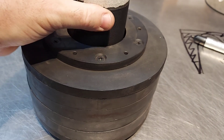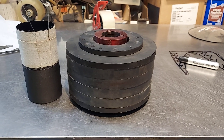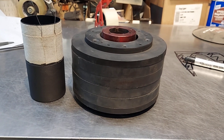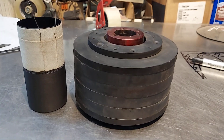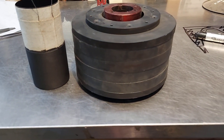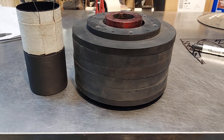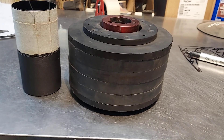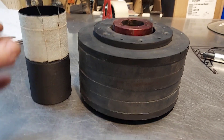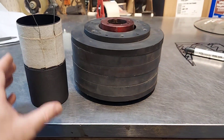The motion actually helps keep the coil cool when it's in the gap. You can send your amp into clipping by turning up the gain too high, but keep the volume on your deck very low. You can hear the clipping — it'll sound distorted — but your woofer will play fine all day long because it's not leaving the gap.